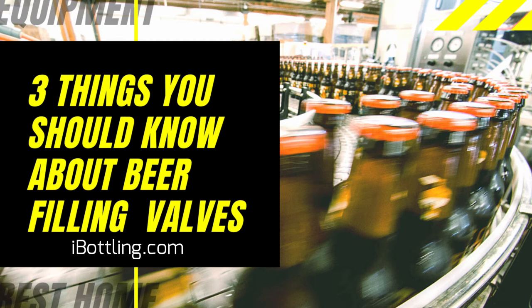The electronic filling valve has the function of steam sterilizing the wine valve. When filling, you need to open the valve to inflate and equalize pressure, then open the liquid valve to return air. The mechanical valve realizes this function by relying on the dial's mechanical method to lift the valve stem's fork. In contrast, the electronic valve depends on electrical control of the cylinder's piston movement, which is stable and reliable. The process of achieving equal pressure filling is also different: the mechanical filling valve realizes the connection of the relevant chambers by controlling the pressing of the guide bar according to time sequence, while the electronic filling valve connects the corresponding chamber through the switch of the pneumatic diaphragm valve, ensuring smooth movement and guaranteed accuracy.